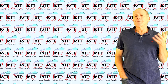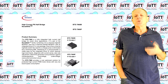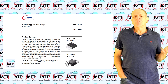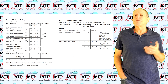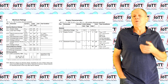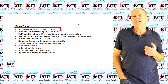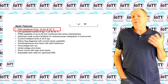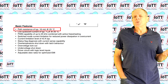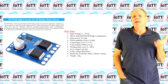After all my tests of the BTS 7960 half-bridge chip in video number 105, it was a given that I wanted to use this chip for my board. The performance characteristics are just outstanding. It supports DC voltages of up to 45 volts and maximum currents of up to 43 amps, so running a G-scale track with 25 volts and 5 amps is rather at the lower end of what the chip can do. Furthermore, it has a very low on-resistance of only 16 milli-ohms, so the power dissipation when running 5 amps will only be 200 milliwatts per chip, making it possible to use it without a large cooler, fitting in the space available between two boards separated by typical Arduino headers.